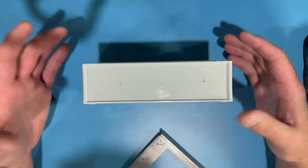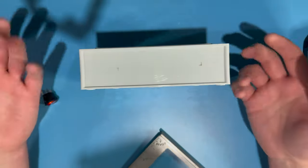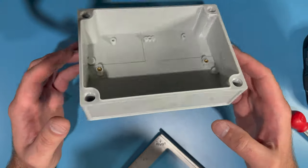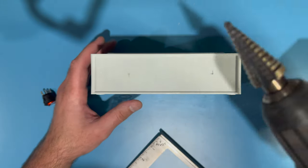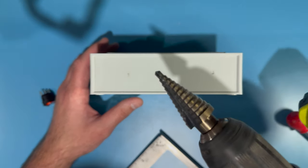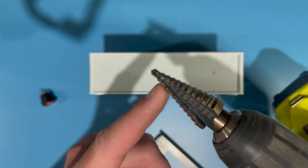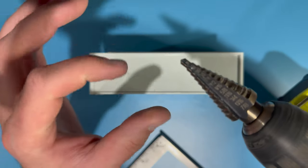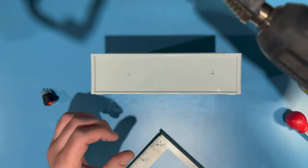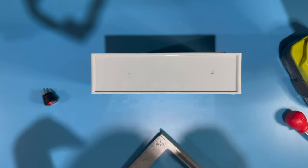The first thing we're going to do is drill some holes into the junction box to mount our various components. We're mostly going to use this step drill bit on the power drill. It has a step pyramid configuration so instead of drilling the full diameter all at once, you do it step by step, gradually increasing the diameter of the hole to accommodate the part you're mounting.